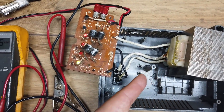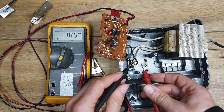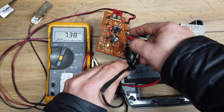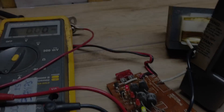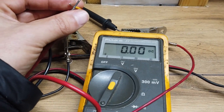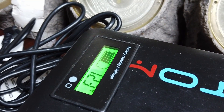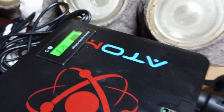I've connected up a DC voltmeter to the crocodile clips and we can see when I switch between 6 volts and 12 volts, the unit is definitely putting out a low voltage. Let's check the output coils of this transformer — the AC output on these windings. We should have something like 6 volts on one, 5 volts on one, and 7 volts on the other, so in total about 12 and a bit volts AC. I've put a DC current meter in series with the charger and we're seeing approximately one amp going in. Connecting the cable, battery voltage pops up to 12.4; disconnecting, it drops back to 12.3.